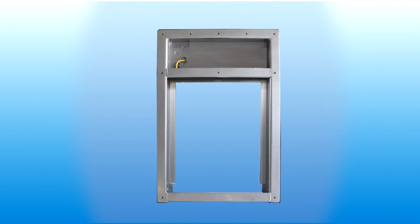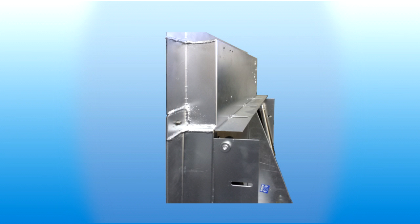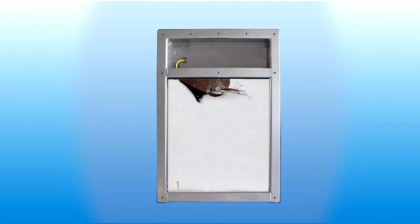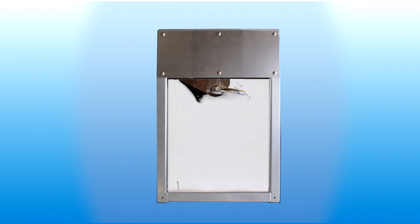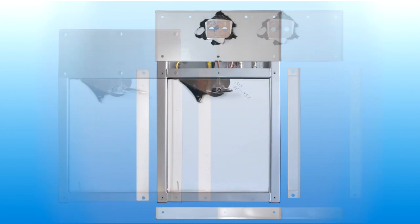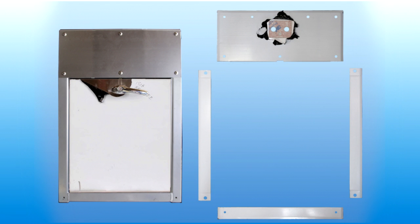With regard to the mechanical design of the chute, all doors are fabricated at the factory. Door panels are pre-hung and the stainless steel finish is protected with a temporary plastic covering. Door locking control components are installed and covered with a temporary steel plate. Door frame trim panels are provided and shipped with all doors.